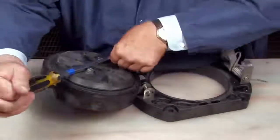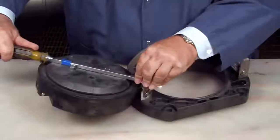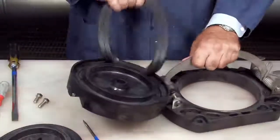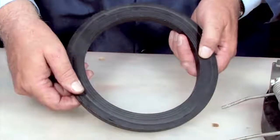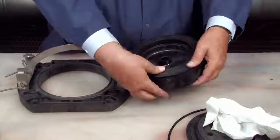Replace components if necessary. For closer examination of the disc, the disc retainer can be removed by placing two bolts opposite one another and loosening the retainer with a large screwdriver placed between them. If one side of the disc has been cut, it can be removed and reinstalled in reverse in lieu of ordering a replacement. If both sides are damaged, it should be replaced.